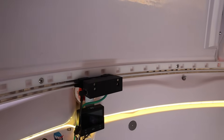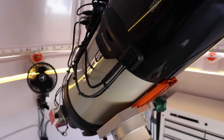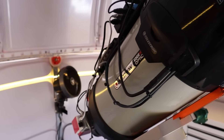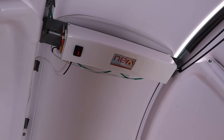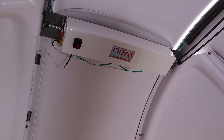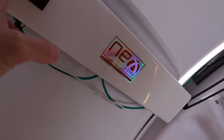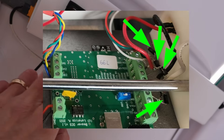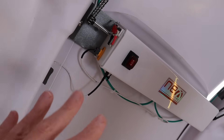I was able to bring the ground in through the negative 24-volt strip because everything in the observatory — the shutter power supply, the rotation system power supply, the camera, the Wi-Fi access point, the computer, the mount — all have isolated grounds. So there's no risk of ground loops or a computer acting strange from two different ground potentials. The last thing we did was protect all external incoming connections into the board. For example, the manual open and close switch wires are protected by TVS diodes where they enter the board, as is the shutter-open limit switch.